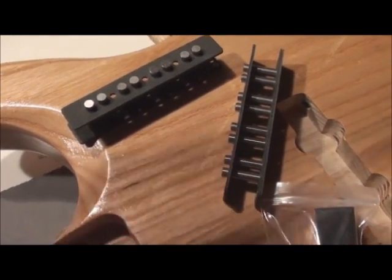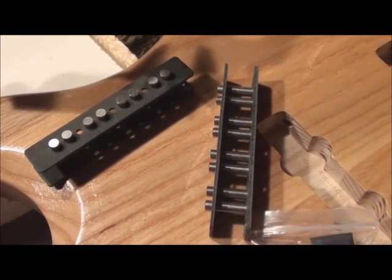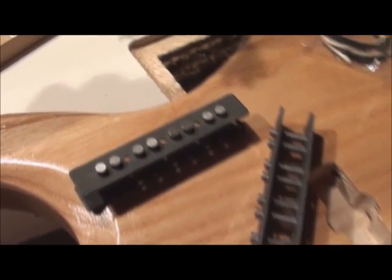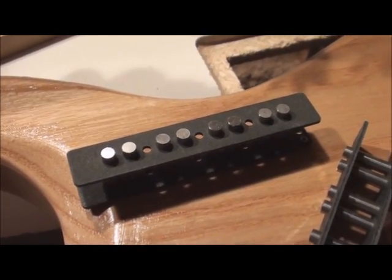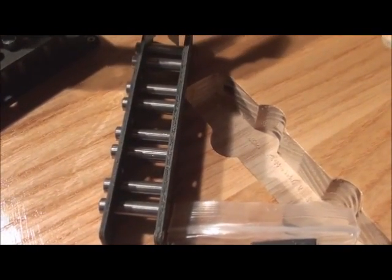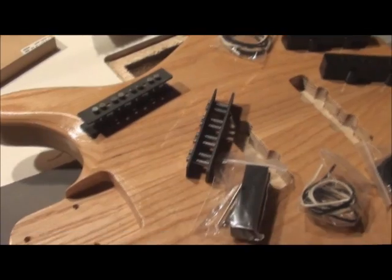Okay, the flat work and installation is all done. These bobbins are ready to go, be dipped in the shellac bucket. And once that's cured, they'll all be ready to go for winding. I made sure all the pole pieces have beveled edges at the top. I checked my distances here, and I should have 17.30. Yes, I do. Kind of upside down because I'm doing this with two hands. 17.30. Make sure it's nice and even all the way along. I have a spacer for that, so we're good. There you go. From here we'll get ready to wind.